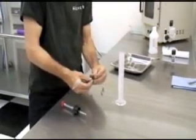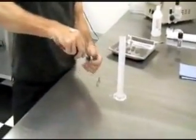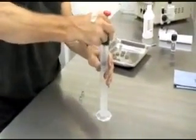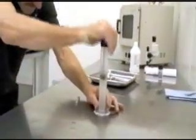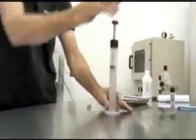You may wash your seals in your rocket washer. You can take the rubber seals, throw them on the plunger bolt without the spacers, put on the nylon nut to hold them on, put them in your rocket washer, and agitate for about 20-30 seconds like before. Now you don't want to leave them in here too long because it will eventually dry out your seal.